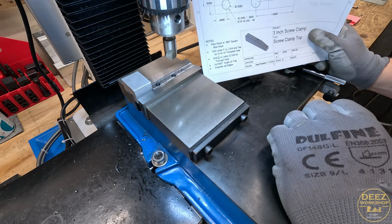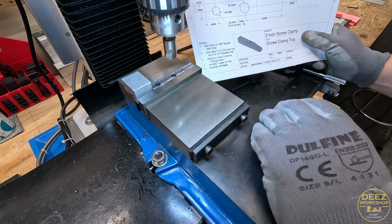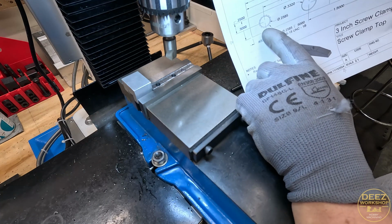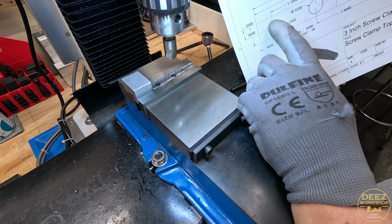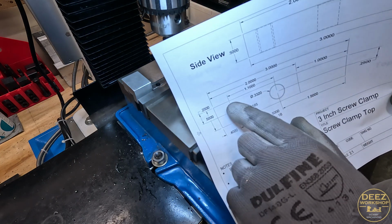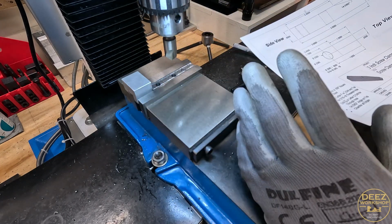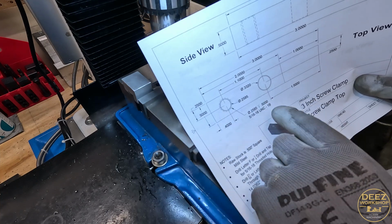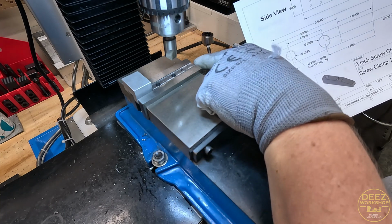Most of this is for having fun in the garage, but I do want to learn and try to improve where I can. So I went back in and decided to update my drawing, number one, because I brought in the whole 400 thou to the center line on the back side. And I wanted to use CAD to measure. So I have distance between centers is 1.1. A lot easier to use this than trying to do math on the DRO, because my only measurement before was from the back side in. So this is going to help. Since I have this hole centered, I know where this is. I used the edge finder.